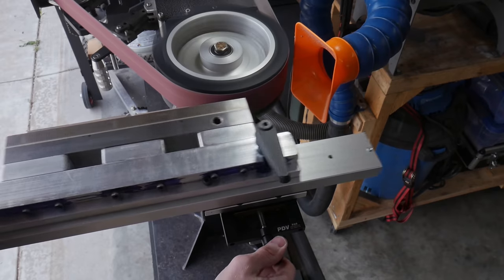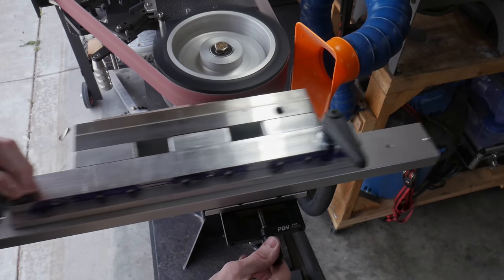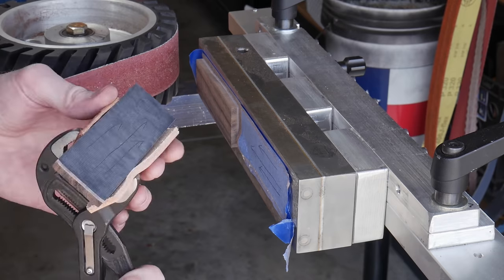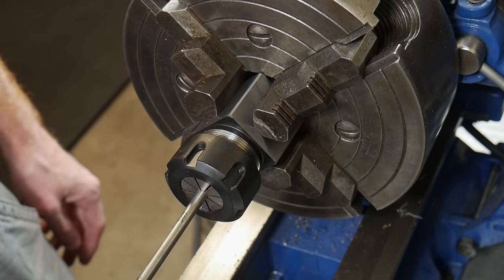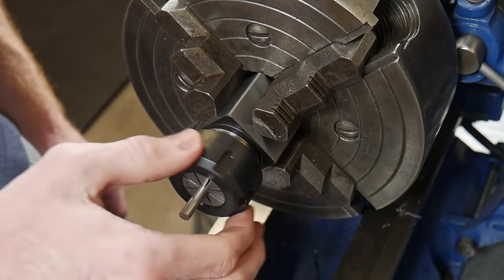Once the handle scales were attached to the surface grinding attachment, getting them down to just over a quarter inch was fairly simple — advance the table towards the wheel gently, make a few passes, and repeat. To get them off I used a pair of pliers, but it put too much torque on the system, so in the future I'll use way less super glue.